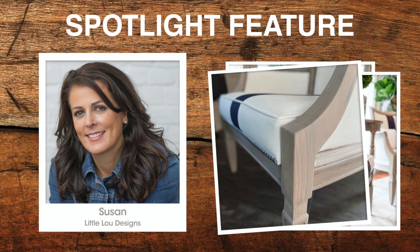A woman bought them and I did take them back because along the seam of the bottom cushion I had to open up the seam a little more to get paint down inside — it was starting to show there. I learned from my mistakes and moving forward I'll make some changes. I used Annie Sloan white wax for most of it, and either Chippy Barnes clear wax or Annie Sloan clear wax over the blue stripes. Once you wax it, do you have to let it sit before you can sit in it? It should cure — about 24 to 48 hours for the wax to cure, and then you can buff it. It won't come off on clothing. It's probably not a bad idea to wax it periodically down the road, just as you would normal furniture to maintain and preserve it.